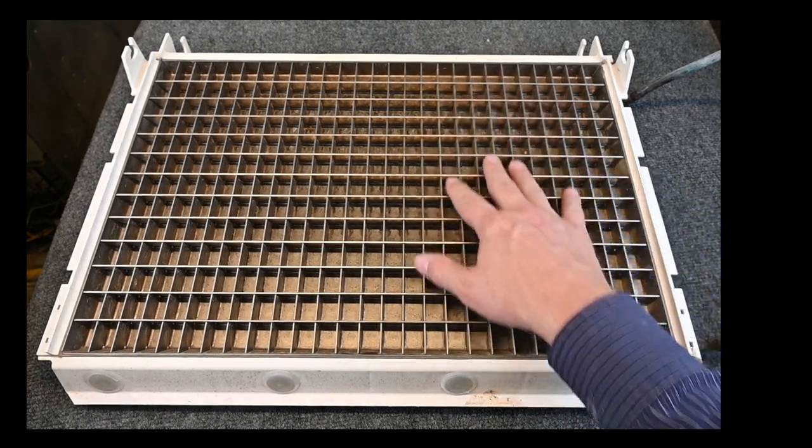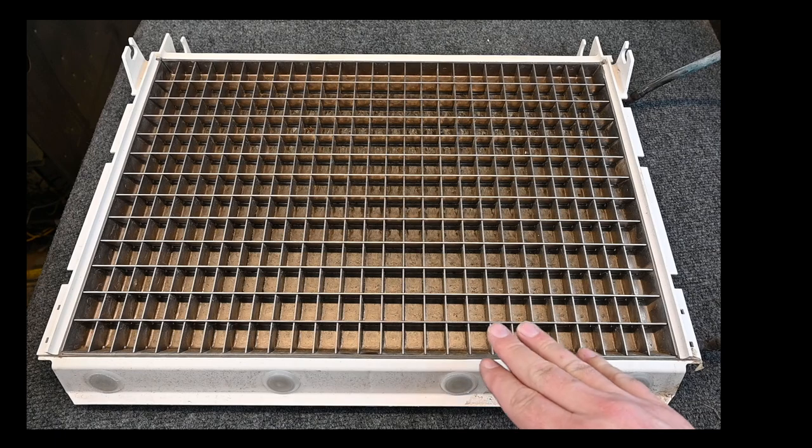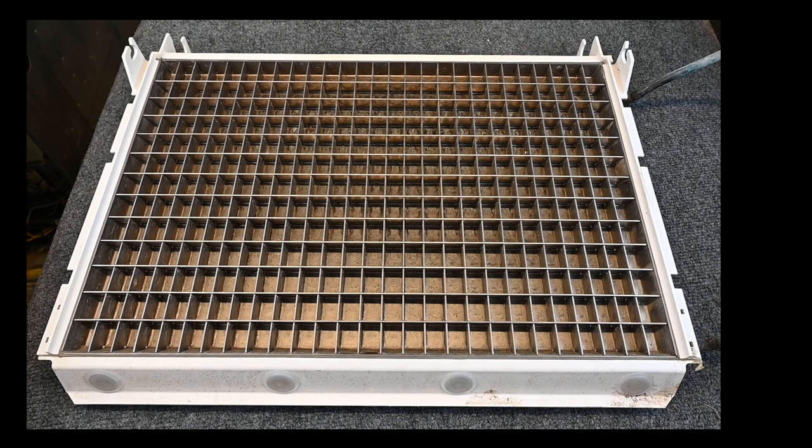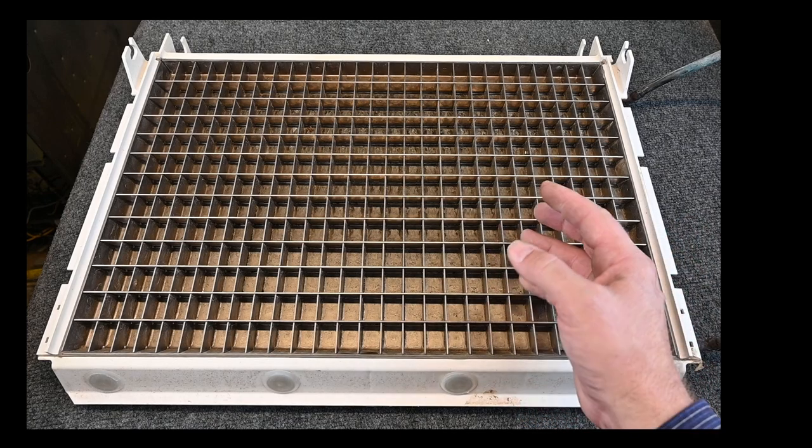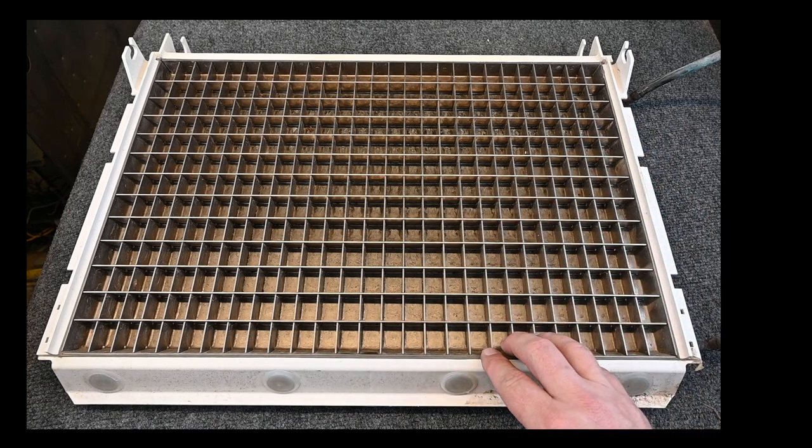And as we're running water over this, we're taking the heat out of water. And if I take enough heat out of water, the water will change state from a liquid to a solid, which is a type of latent heat. And we're gonna talk about ice here shortly. So we have several things about defrost and harvest cycles that we are able to get that ice back out.